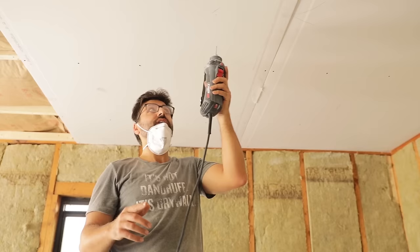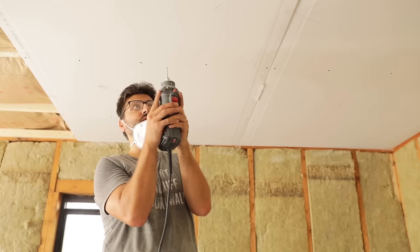This guy, you just mark it out, stick right in the middle, go to the outside, and then go clockwise. And the blade actually follows the seam and works its way in towards your light fixture if you go clockwise. If you go counterclockwise, it'll like spin off into space. So don't do that.